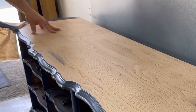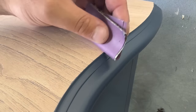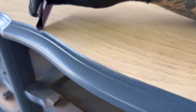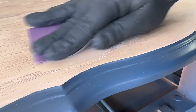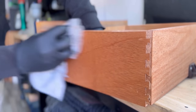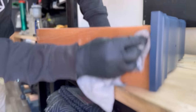I remove all the tape and masking paper to reveal that little bit of paint overlap I mentioned earlier. You can take a 220 grit piece of sandpaper and lightly sand that edge off to create a really nice crispy line between the paint and the top. When I removed the paper I noticed some overspray that got under the tape onto the clear-coated top. I took care of it by scuff sanding it and working polyurethane into that area with a microfiber towel — once it dried you'd never notice.